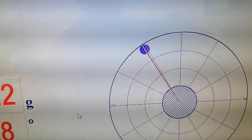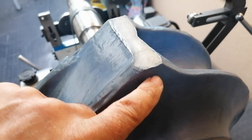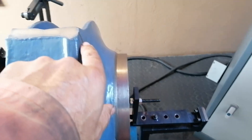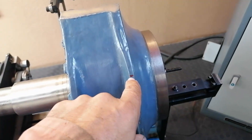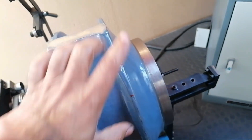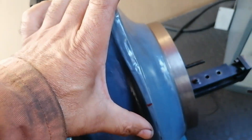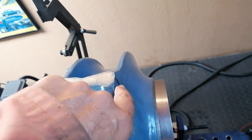She's there - you can see she's in the center, so she's heavy here. I think I'm going to grind this area here. I've made my mark - I'm going to take it off the machine, grind there, put it on and see what she does. If you recall, that was my top mark earlier and twice that mark landed at the bottom, so yes the weight was definitely in this area here. The computer, being much more accurate, says it's actually here - which is in the proximity of that mark, so we're definitely on the right path.